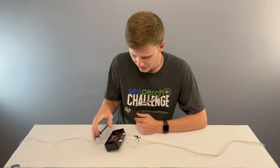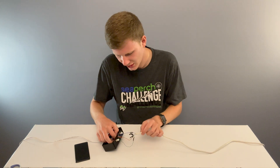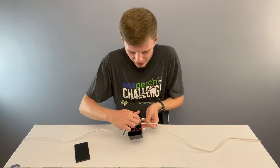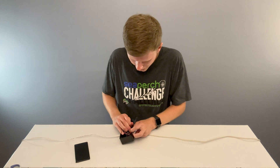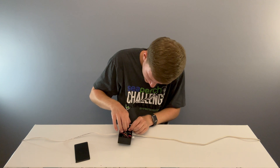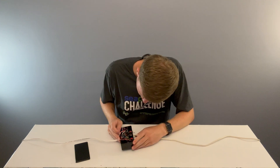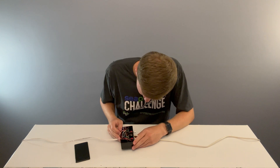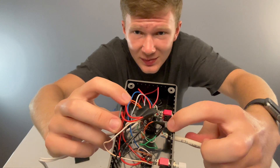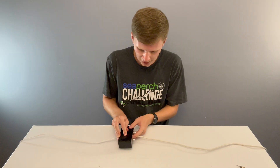For those who built their own controller: take off the top and pull the colored wires in until you get to the insulation. Once you see the insulation poking through to the other side, take a zip tie and tie it around this part super tight and then cut off the end. Make sure that all connections are still completely wrapped in electrical tape so no metal accidentally touches and causes a short. The zip tie right here prevents the wire from being pulled out anymore. Now just put the lid of the box back on.